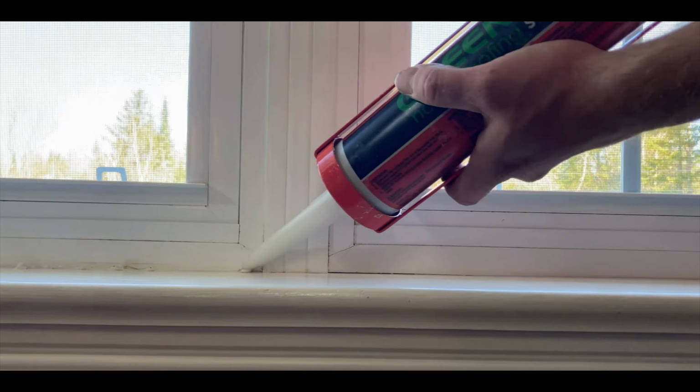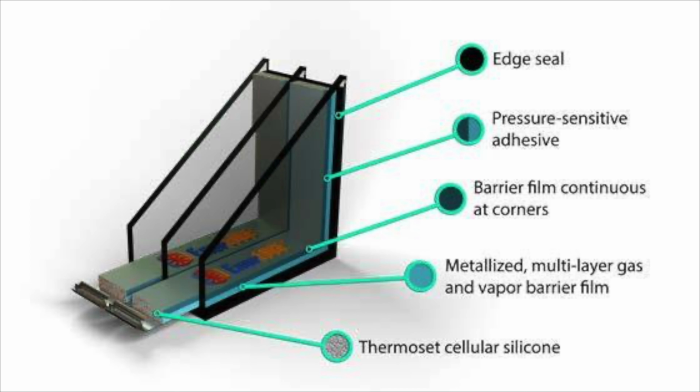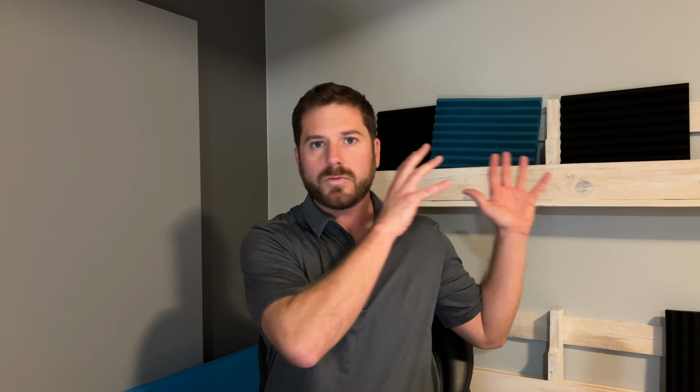So let's begin. The first thing that you should soundproof, of course, is the window. Well, let's hope that you don't have a window in the room that you will be using for drums. If you do have a window that you want to soundproof because of the noise coming in or going outside, then the best way is to completely block the window, or to replace it with a triple pane window if you don't want to completely get rid of the window itself. Usually when you're soundproofing a room for drums it's mostly the walls and the doors that you'll want to look at.